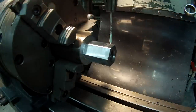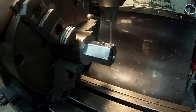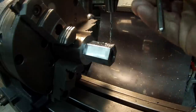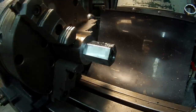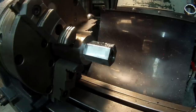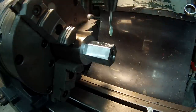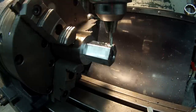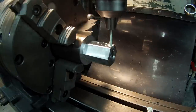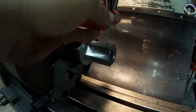I'm going to use my drill here with some anchor lube. I'm using a two-flute spiral-pointed tap and I'll anchor lube that up as well. Drop it down in low gear. Alright, there we have it. I need to do four more — I've got to step it down.